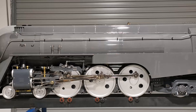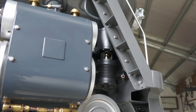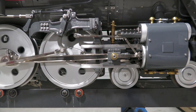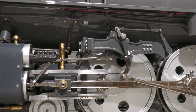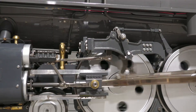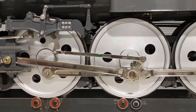The majority of the locomotive frame and cylinders is as per Little Engine specifications. Behind the front shroud is a single water pump on the left and an air compressor on the right from Keem Steam Pumps. Cylinders have an 89 millimetre or 3.5 inch stroke and a 63.5 millimetre or 2.5 inch bore. Hiding behind the crosshead is the lubricators for the pump and compressor. The locomotive is fitted with Baker valve gear instead of the Walschaerts as standard with the Little Engine drawings. Drawings from Brian Keem assisted us in retrofitting the Baker valve gear to work with the Little Engine cylinder stroke length and porting. Where able to, rods and linkages have been nickel plated.